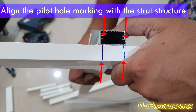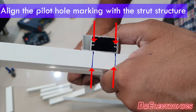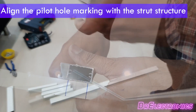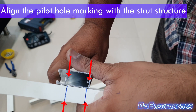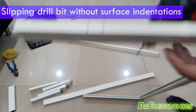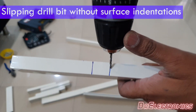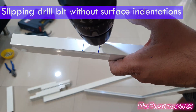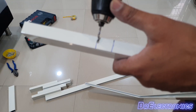I had to align the C-shape groove in the structure with the pilot holes for the screws. The alignment had to be perfect so that the screws could hold the structure with strength. Just for the sake of demonstration, this is what happens when you start using the drill without making indentations for the pilot holes — the drill bit starts to run off from the mark and will definitely miss the spot.